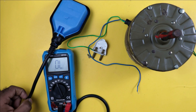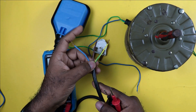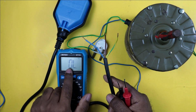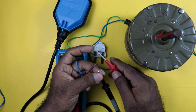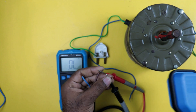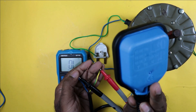In the cable of the float switch, you will find a total of three wires. You have to identify which one takes input power supply and which one gives output power supply. For identification, select the continuity position on the multimeter, connect the probes to the wires, and check by moving the float switch upside and downside. Right now there is no continuity, so I am interchanging the wires. When float switch is downwards, continuity is there; when upwards, there is no continuity.